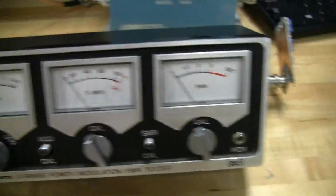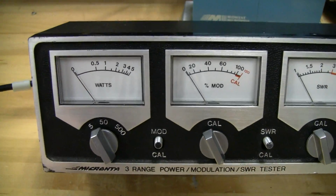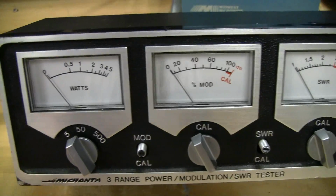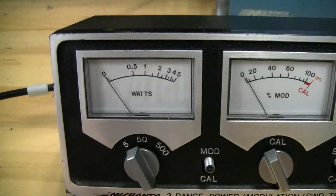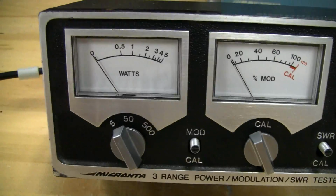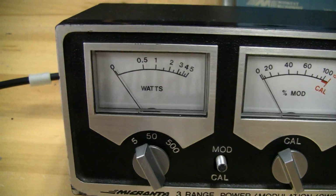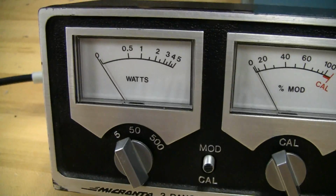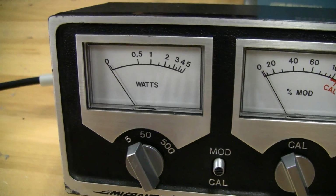I don't really want to speculate, but I want to stick to this one because this is a more available meter. And the one thing to remember with a cross needle meter like this, or these analog meters, is that they're actually using a little bit of the signal to actuate the needles. And so what you can run into is something called the observer effect, where by measuring or observing some value or parameter, you're actually inherently changing it.